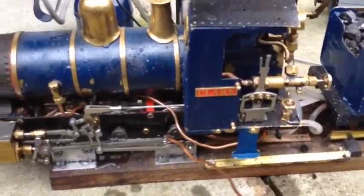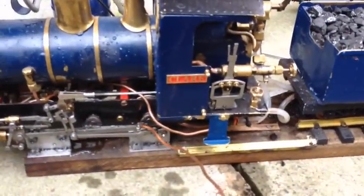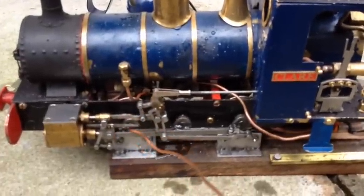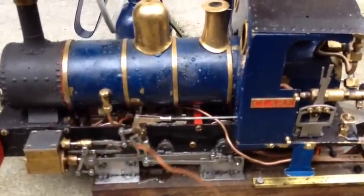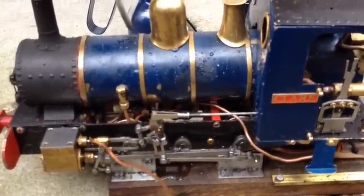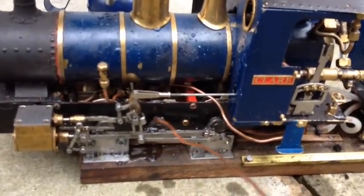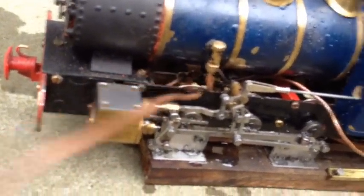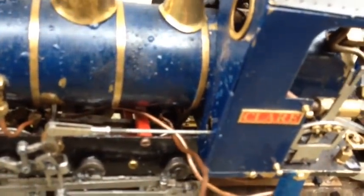First you need to oil around the engine. There's a very long copper pipe on this one because I have five-inch and three-and-a-half-inch gauge engines as well, so the longer pipe is needed to get between the frames. You basically want to oil all the moving parts. If you're not sure, I would recommend that you literally turn the wheels round and see what moves and oil everything that moves. You need to make sure that everything is oiled, including the axle pump between the engine and the eccentric at the back which is running off the axle.